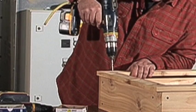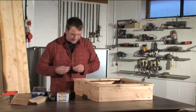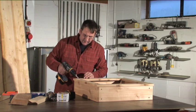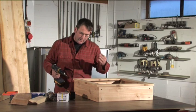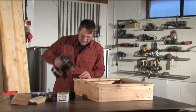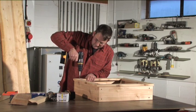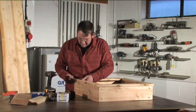And then fix from there. Once again, don't want to go too close to the ends because you'll end up splitting. So come back in from the saw cuts - from the end of any timber you want to come back in about 15 millimetres, which is about a centimetre and a half. Put the screw in. Down we go. Put that one on.